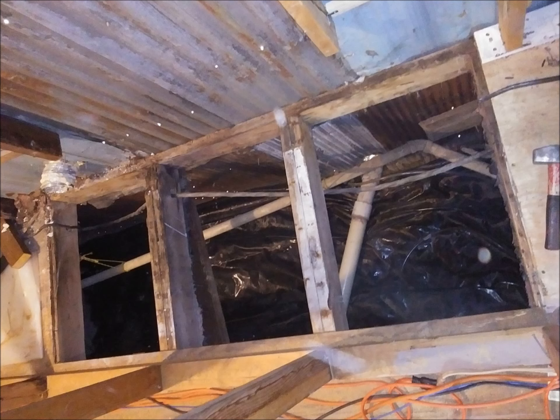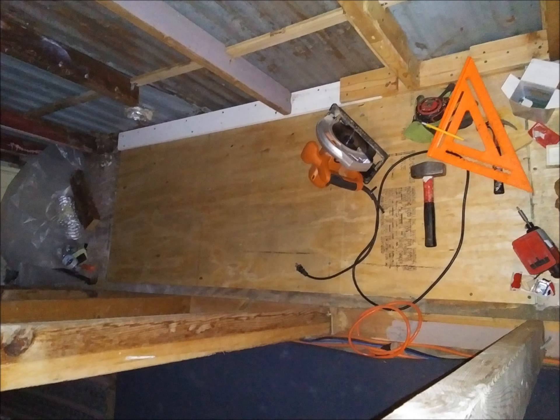Here's further down underneath where that old door used to be. You can see where the color difference in the siding is. This part of the rim joist is bad too and the ends of the joist are rotted away. So I have to cut off the ends of the joist and sister them and put in — I believe it was a 4-foot section of rim joist — to repair this area after I cut off the floor. Unfortunately I had forgotten to take a picture of that repair of the joist, but you get the general idea from my previous picture. So here I have installed a new sole plate and reinstalled the 2x4 studs and cut a piece of subfloor to reinstall back on top of all of it. This area is repaired and ready to go.